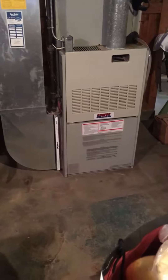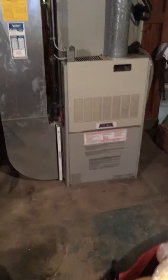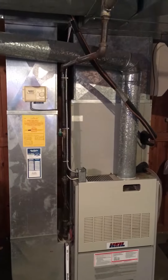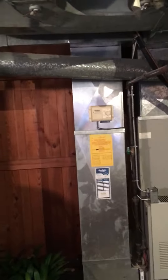We're looking at a 150,000 BTU furnace and looking at replacing this. It has a cracked heat exchanger as well as the evaporator coil and supply plenum. The return drop is 10 by 24 by — I believe 79 and a half, I have it written down. We want to look at moving this over some to allow for our 5-inch filter.